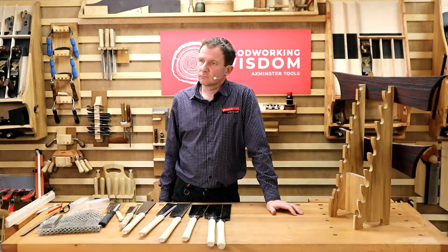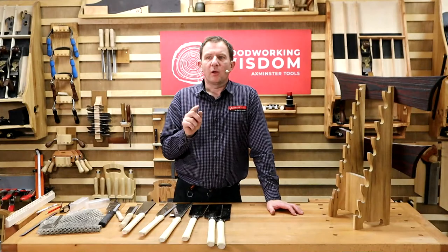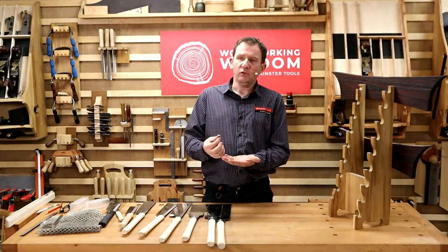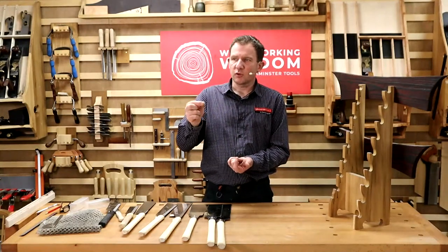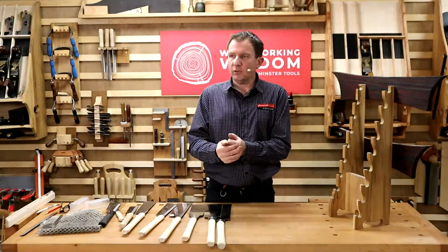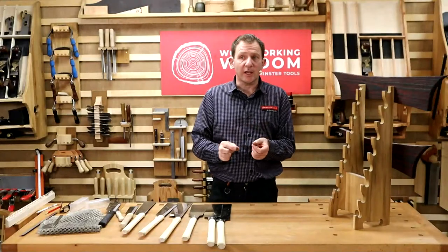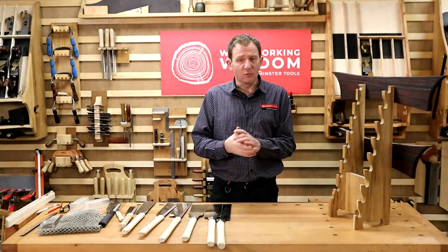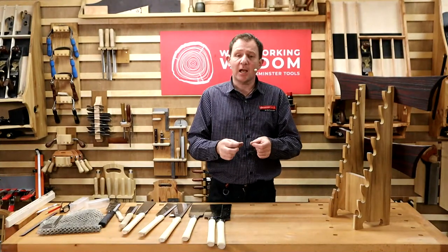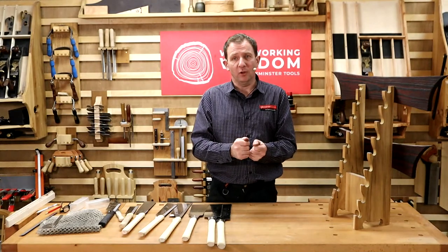Bill's asked: with the three holes and the chamfer bit routing, did you get much tear-out with the grain direction? Nice and slowly as you go round — don't do it in one heavy cut. You've got a bearing-guided cutter, so you're running off the substrate. Go round it, then lower it down a couple of millimetres and do the next pass. You spent all the time making the box — it's amazing how we get caught up in wanting to quickly bang it out. Actually, go round it two or three times to get that overall effect. It doesn't take long and there's less cleaning up. No real problems with the breakout — the only thing to watch is as you come round it doesn't fly off that edge and come back in. Control is the major thing, and a lighter cut puts you more in control.